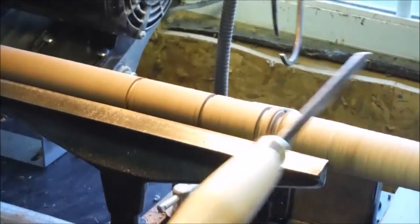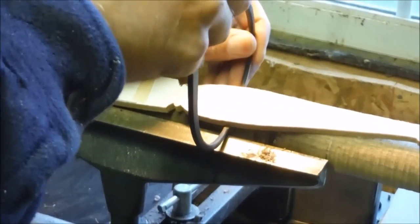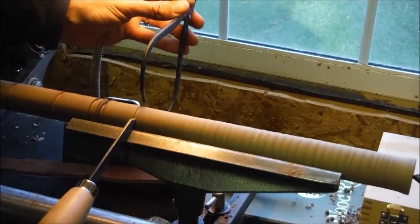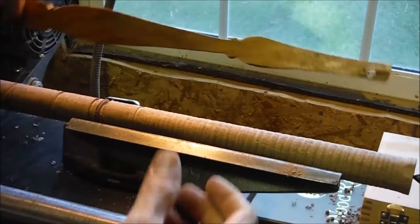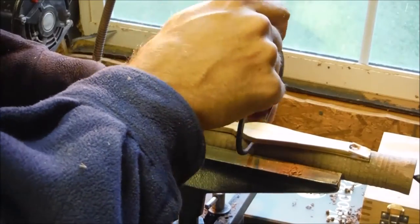You can see I had to widen the spot where the parting tool went in because the calipers get squeezed a little bit by it. It's good to take your calipers and actually grind them thinner if they need to be — I did that on these.